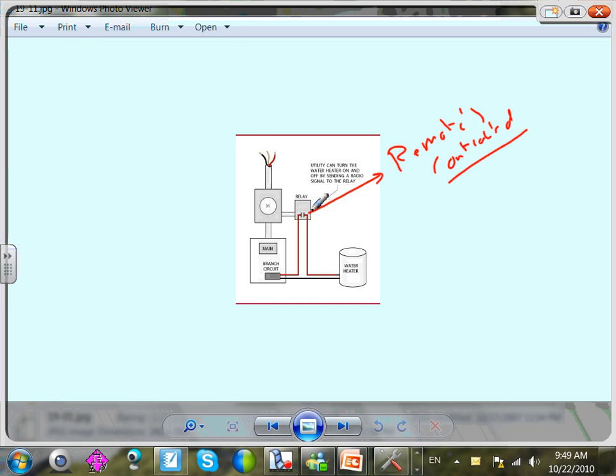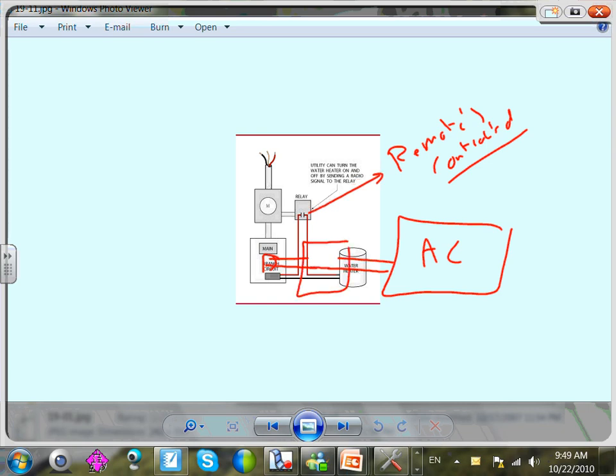They use it also in Minnesota. That's your saver switch, AC, the same way. You bring another circuit breaker to your AC, except I made it wrong here. So you bring one conductor in, and this is your relay. You bring them through a relay, and through this relay, you remotely control. It's just a contactor, guys, a relay. Open it and close it to control this load.